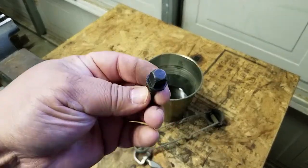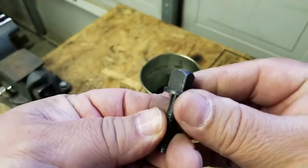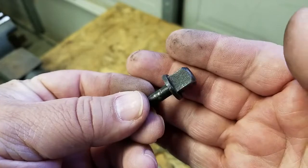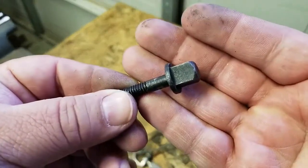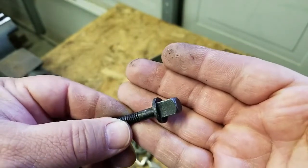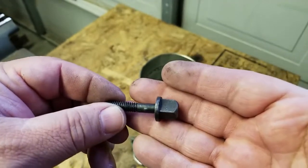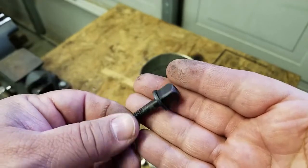Well, here it is. It's pretty black. You can see it's kind of sooty, but it is black. One surprising thing I discovered is this was made out of mild steel — just cold roll. You saw me heat it up. Full disclosure: I dunked it in the oil twice because I forgot to turn the camera on the first time. So two times red hot, twice in the motor oil — used motor oil with a lot of burned carbon in it. This thing actually picked up a degree of hardness, so it's some kind of case hardening.